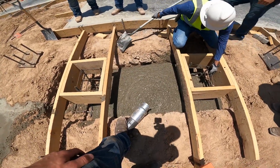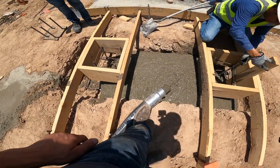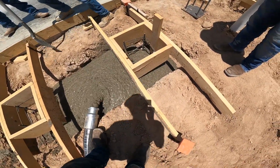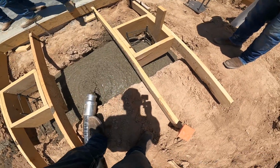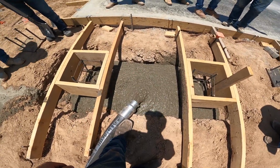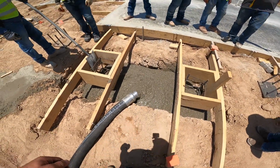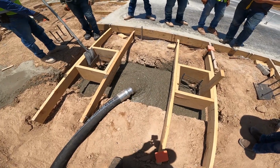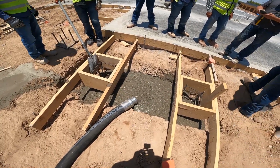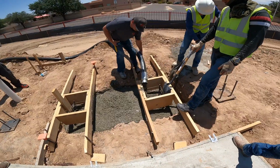But so you can go through. See, if you wanted to, you can just slow it down, like the 50. But if that's running low flow, there won't be no change on the remote because you're only giving it, even at 50% on the remote, it's still by theoretical volume of potential. So that's still 15 gallons a minute. So that's what you're at now. 50% of the remote of that machine is going to already be 100%. So we will have an update on the remote. When you push the bottom two buttons, it will switch from low flow to high flow, so that you have better control of low volume, right? And then you can switch.